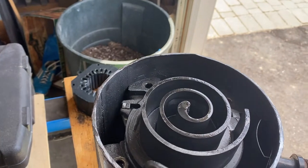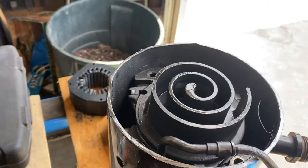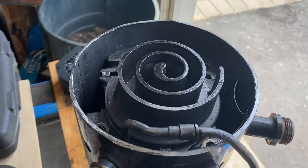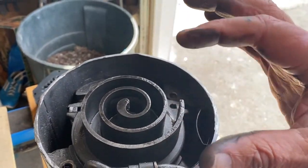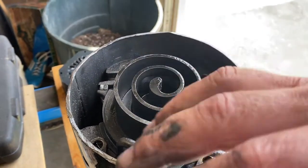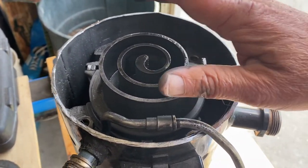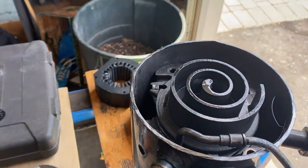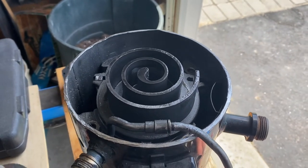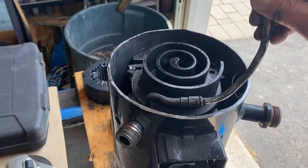Scrolls are very forgiving. On the top of this head assembly, if something happens — like if discharge pressure gets too high or liquid returns to the compressor — these scrolls will actually separate. They'll still be turning but there's no pumping until pressures return to normal, then they remesh. It makes quite a noise if you're standing beside one when it happens. Scroll compressor failures are usually electrical, sometimes mechanical, but not as often. That's the nuts and bolts of the scroll compressor — and it's cool how we found out exactly what caused this one to fail.